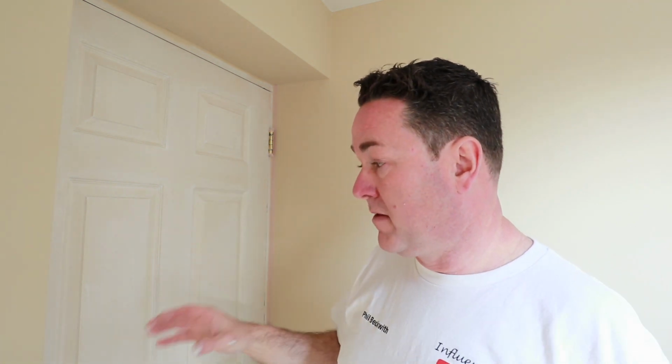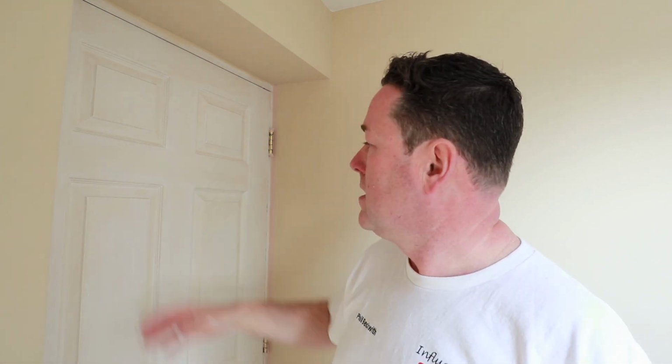I've got quite a bit of cleaning up of hinges from previously when it was painted with the original contractors. You can still see the white paint on them. I'll go around with some cellulose thinners and a bit of a scraper, and try and get them cleaned up the best I can when I've finished the whole job and the project. Other than that, we're straightforward on this. I'll show you painting it and we'll fast forward through that. On the whole, I'm good to go on this.